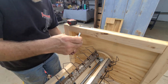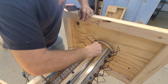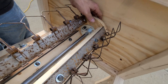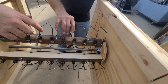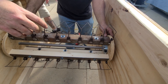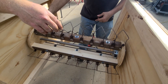You ready? Piece of three-sixteenths key stock — shaft spline, hub spline. The important thing is you have to give yourself a little extra clearance here; that's why it took me so long. I had bolts on this side and bolts on the other side, so I kept sliding it over until I got it right. Now I put the key in, I've got the bar set to the shaft, and I give myself enough room and pull it over where I have some gap.